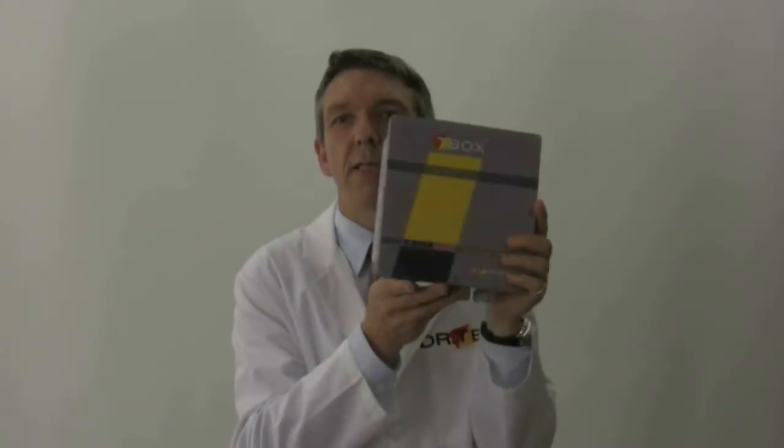We also provide a range of ultra-low power T-Box. It consumes some micro-amps, runs with lithium batteries and is available in an IP67 enclosure. It can be used in hazardous environments according to Class 1, Div 1, Div 2, ATEX 1 and ATEX 2.